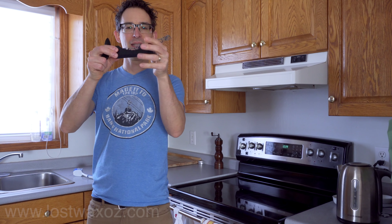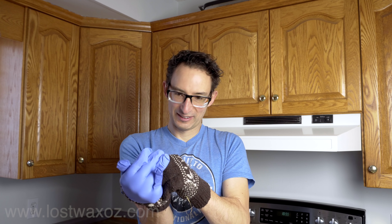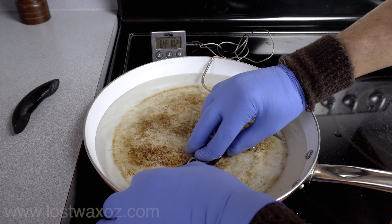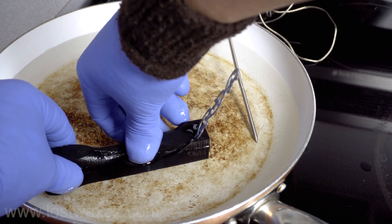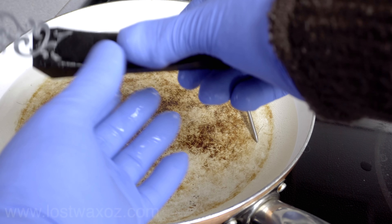I needed to smush the swirly strip into the forming die and make it perfect — probably not going to work, but let's try. While the water was heating, I made my own high-tech waterproof insulated gloves. They worked really well to protect my hands from the 70 degrees Celsius water, though not the easiest to put on and take off. I found it worked best to submerge one half of the forming die under the water to keep the swirly strip nice and pliable the entire time I was forming it. First I would use my fingers to press the plastic into the die — it's incredibly amazing how pliable the plastic is at 70 degrees and yet it still keeps its basic shape. Once I had it jammed in with my hands, I used the other half of the die to really press it into shape and held it there while taking it out of the water to cool.